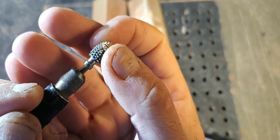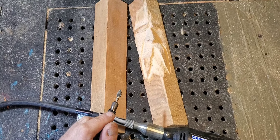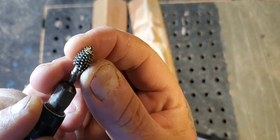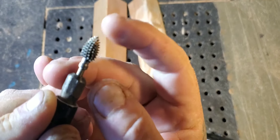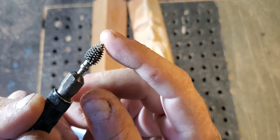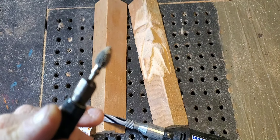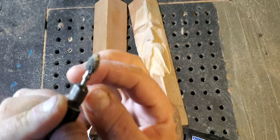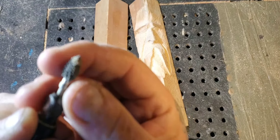This is the Kutsal Extreme Flame Burr — all the burrs I basically use are Kutsals. You can look in the description; it will take you to the Kutsal site. Use the code CFUSION to save yourself 5%. The reason I like using Kutsals for carving is these 1/8th burrs fit the Dremel flex shaft, and these points are the strongest I've found out of any burrs — they last the longest. They call me Heavy Hands because I carve so fast and burn things out quick.